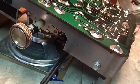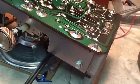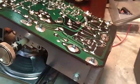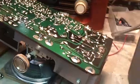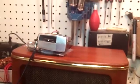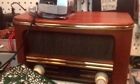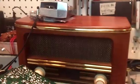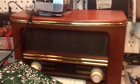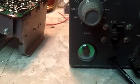I can poke various places and sometimes make the noise go away, but I think that's just from rattling the board. I also have the little Panasonic up there — I found two bad circuit traces, actual wires that were loose in the circuit board. I'm going to sort that out and get that working, see if that fixes it. And we'll go from there — making progress.